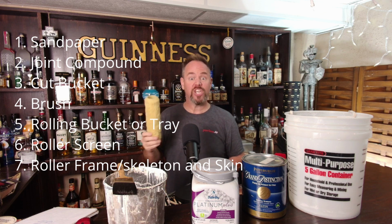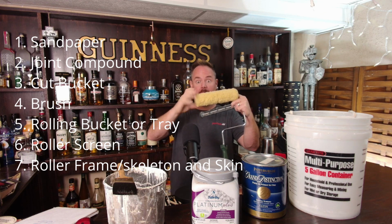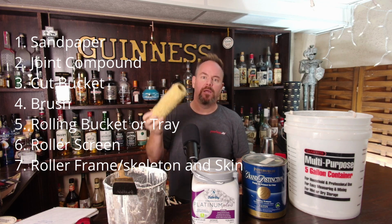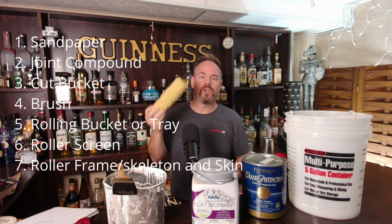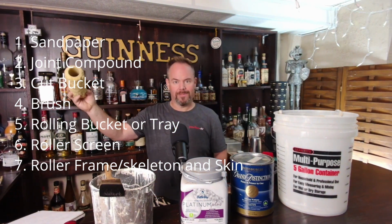You can even buy a 1 inch nap if you want. And those buggers are thick, man. I'm telling you, these things are thick. All right, but that's going to determine how much paint your roller is going to hold when it gets from the bucket to the wall.